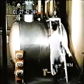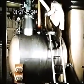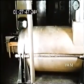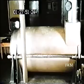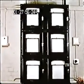The amount of liquid collected in the hot well is small, except during the periods when the sphere is being sterilized. Air withdrawn from the sphere is sterilized by being passed through the electrically heated vent heater, which is controlled at a temperature of 350 degrees.